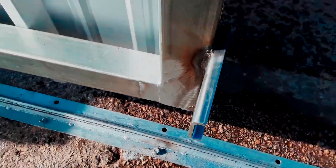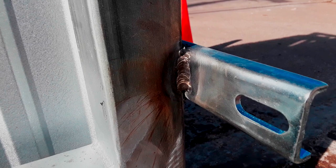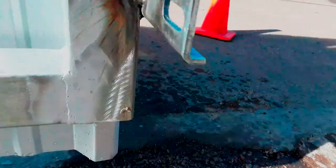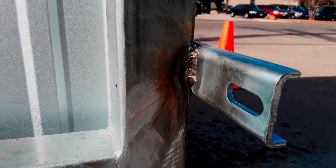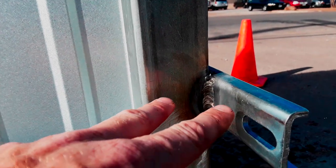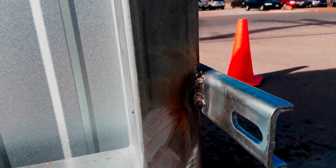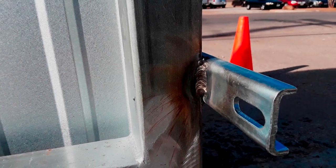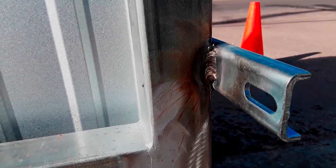The front chain bracket is welded all the way around. Now that we're 100% sure it's level, straight, and not going to cause any obstructions, I'm going to spray paint it first - you can see all this water, I just cooled it off and dried it. So I'll put that galvanized paint on there, which will let me get paint back in here before I weld the gusset over it. I'll paint it now while it's clean, cool, and dry, then put the gusset on.